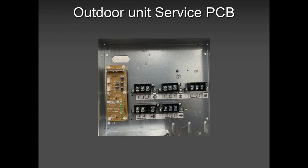So what's going to happen with the next compressor? Same story. You have to make sure there is no pipe traps. P traps, U traps, not allowed. No intentional traps, guys. Number one. Number two, always remember to add refrigerant when you cross the limit of charging, the limit of the factory charge. When you cross it, remember to add refrigerant. Please, you will have no issues with these compressors.